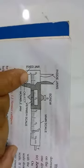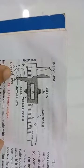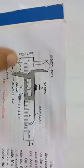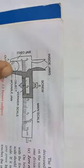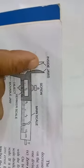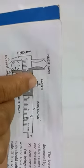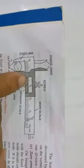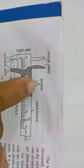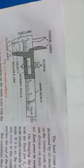You can see the Vernier scale has 10 divisions shown here. Then you can see the jaws. On the lower end, you can see two jaws marked by J1 and J2 — these are known as the outside jaws. At the top, the construction of these jaws is straight on the inside, whereas the outside jaws are curved. There is also a screw which tightens or loosens the movement of the Vernier scale on the main scale, and a tail or strip part.